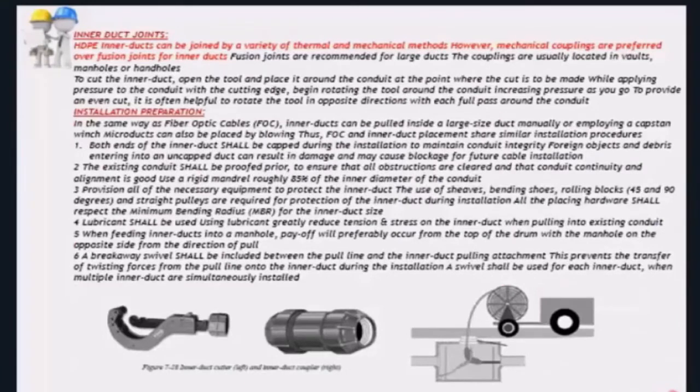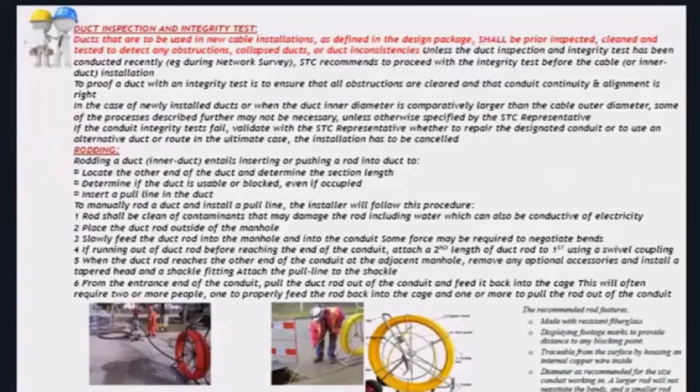The jointing of ducts and micro ducts is as important as the installation procedure itself. There are different types of jointing methods for micro ducts and ducts used for FTTH. They are typically mechanical jointing — we are not welding conduits, as might happen for bigger size and different material ducts. This is the typical duct coupler or adapter for large size ducts. The important point is that you always cut the ducts and micro ducts with the duct cutter, which is the only tool allowed to cut micro ducts and ducts. Do never use a saw — that is not allowed.